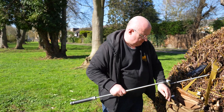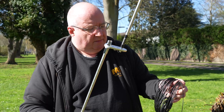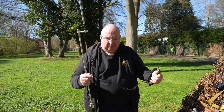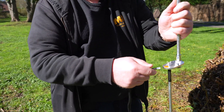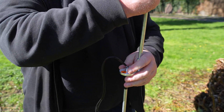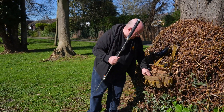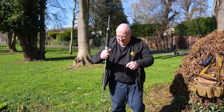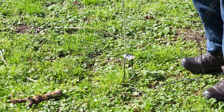Now we're going to need some form of counterpoise. We've got one which is going to be reasonably big — a bit bigger than what we need, but they come in tuned lengths. First time you use this, it's a brand new antenna, so you're going to need to separate the little leads. I'd recommend coiling each one separately so you can wind them out easily. On here you can see there are little spade terminals and they simply push on. What band are we on, Richard? 20 metres. So we're going to be playing with 20 metres — this will be perfectly good enough for that. On top we need the telescopic whip, and that for the most part is the antenna put together. I'm going to put my foot down and simply push the spike into the ground. And that's it.